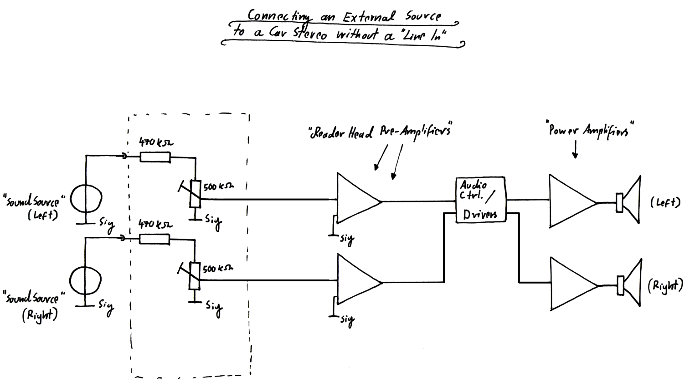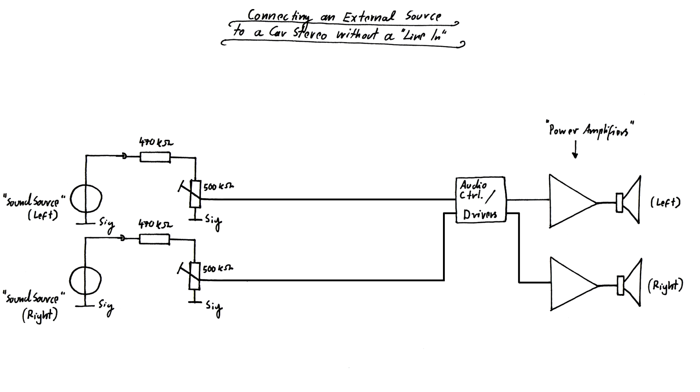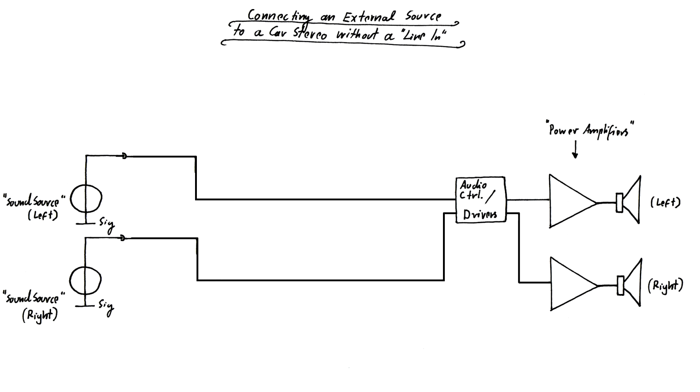The values for these resistors shown here are experimental and are also determined by what I happen to have lying around in the lab. Should the sound quality prove to be very poor, I will then go for another approach and completely remove the preamplifiers from the PCB. Another board with a very different voltage divider will then be added to the stereo system instead. And under optimal circumstances, no voltage divider will be necessary at all.